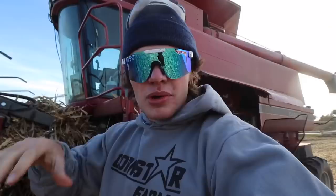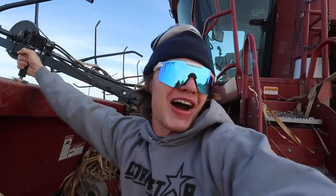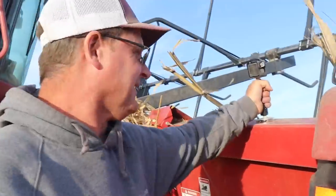While I'm out here, I'm going to open up the rock trap quick. The rock trap is a little pocket inside the throat — so in case we suck up a rock, it's supposed to fall in there before it goes through the combine. And yeah, that magnet is strong. All right, Dad, stick it where you want and try pulling it off. Geez.